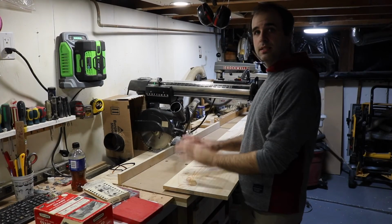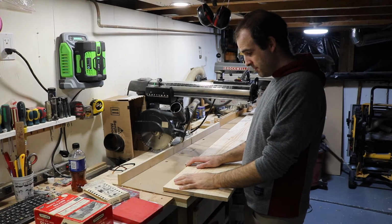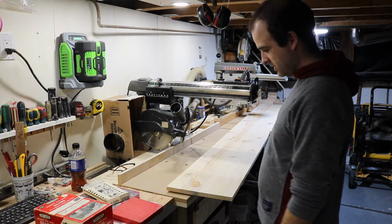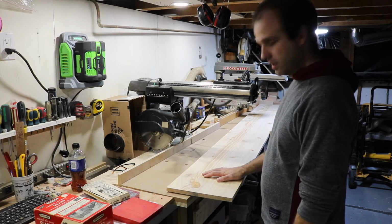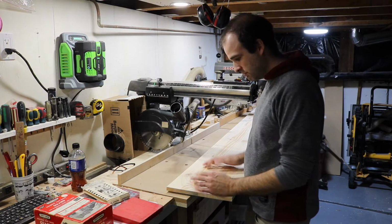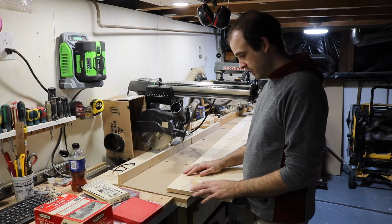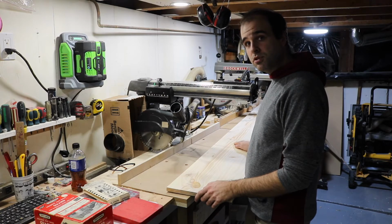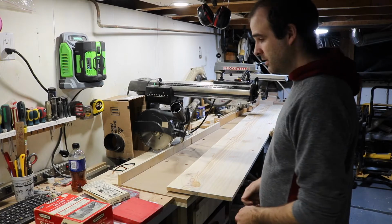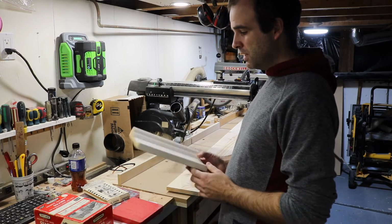Next up, lumber choice. I have previously used pine with great success. This time around, I'm going to try using this, which is what Home Depot sells as, I believe, laminated whitewood, which, to be honest, to me, looks a heck of a lot like pine. I know it's just some junk wood that they've cut, glued and laminated together, plain, smooth, and filled. But since most trim is going to be painted anyways, I didn't see the reason to buy anything expensive. And indeed, if you buy something expensive, suddenly making your own molding doesn't make as much sense.